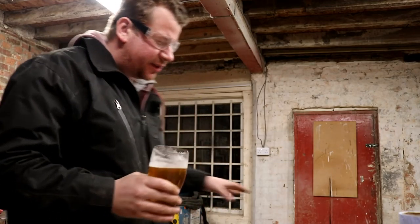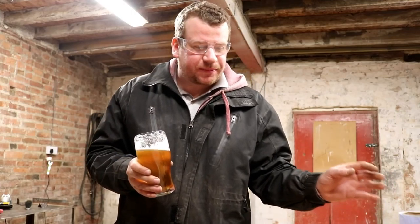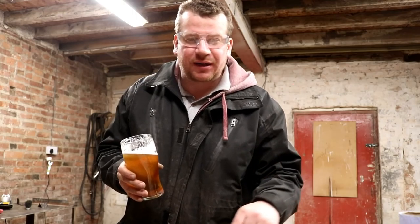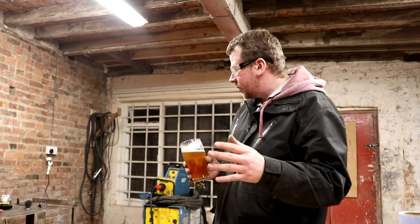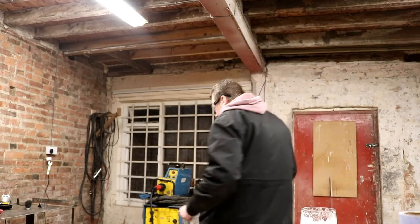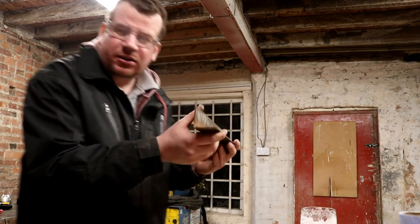Right, so I've got the grinders, which I had to use considerably to tidy up the welds on those stools. Some of the joints were really quite big and the metal was so thin it had snapped off, so I just filled it with metal and then ground it neat. But what I've noticed is the grinders are in the way on the table, so I want to set it up so I've got somewhere to hang them. So I've got a piece of steel. I'm going to stick this piece of angle to the bench like this,